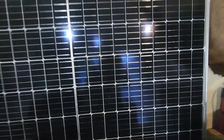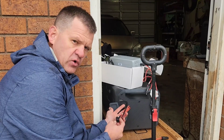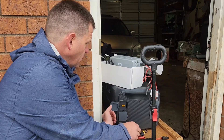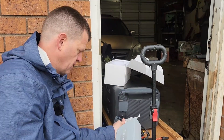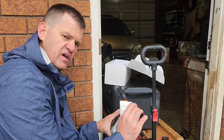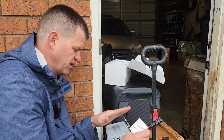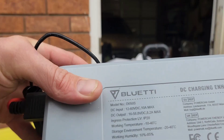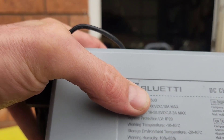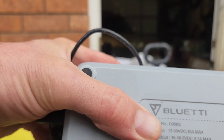I'm going to try connecting this 315W solar panel to this unit even though it only allows 200W — let's give that a try when the sun comes out. Even though the solar adapter can only accept 200W, you can add more solar by getting the DC charging enhancer, which hooks to the bottom port. You can also hook solar panels onto that, or connect it to your car's cigarette lighter. This one can charge at 500W, and its input range is 12–60V with an output of 16–58V.